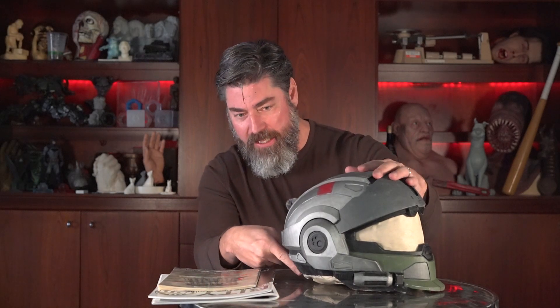So let's start with the mold design, because without a good clear idea of how we're going to proceed, it's going to be hard to choose material and casting material to go into that mold. For this helmet, because it has a lot of straight lines and a lot of detail I want to preserve, I'm going to do this as a seamless mold. I could put a seam down the back or across the whole helmet, but I'd have to make sure that seam lines up exactly with one of these straight lines — and having a straight line that follows another straight line is just a lot easier to sand and clean up later. But in this case, for the sake of this prop, I want this to be a seamless mold.